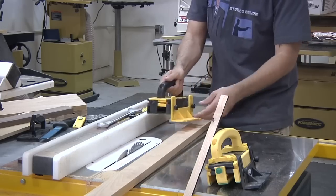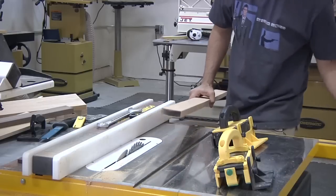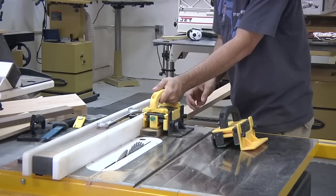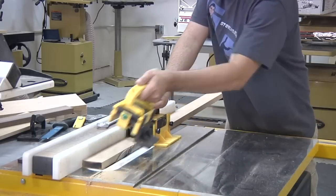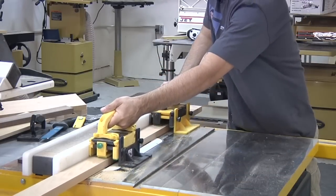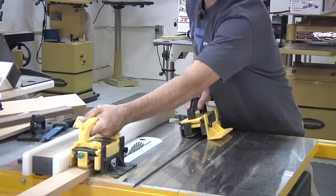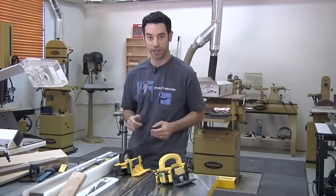As you can see, you've got complete control of the work piece. Even when one Gripper is all the way back here, that one bit of support stabilizes the entire piece because you can put quite a bit of your body weight on it. So as you're pushing through, you go through the motions on each one — there's never a point where you don't have control over the work piece. It stays up against the fence the entire time for a nice consistent cut, and even at the very end of the cut, you still maintain control.